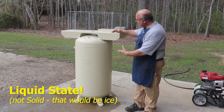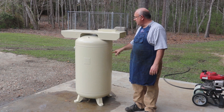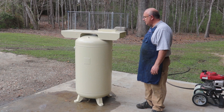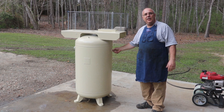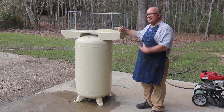Enough talking, let's get in here. I'm going to put the pressure washer on here. We're going to fill it up from the side until we get the water to the top, cap it off, run the pressure up, probably hold it there for about five minutes, and assuming we hit that 225 number, I'm going to count this as a positive and put this tank in service. If by chance it were to fail, then it goes to the scrapyard. Let's do it.